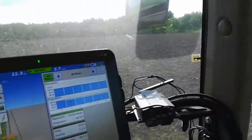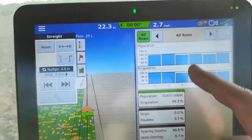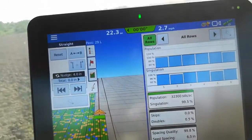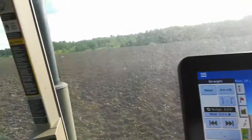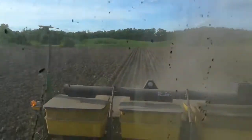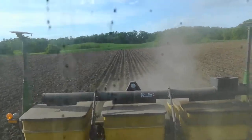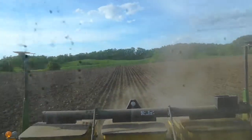And then there's a light sensor in that seed tube that is registering each seed as it goes past, telling me that yeah, I am in fact doing what I think I'm doing. Because, as you can see, probably behind the planter — if it's not too dusty — it's pretty hard to tell what you're actually doing, because everything's two plus inches below the ground.